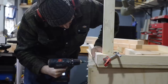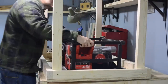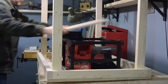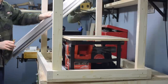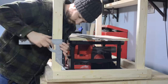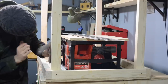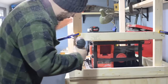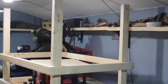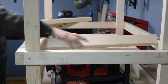Another reason for making my own custom bench is I want it to be a few millimetres higher than my outfeed table, so wood will pass nicely over it onto the table. Originally my plan was to use the little square that came out where the saw went in for the saw to sit on itself. I got that in place and then got a straight edge — one of my Festool rails — to mark out where the second frame will go. Later I decide I don't like that bit of wood there and I remove it, but it still worked for marking everything out. I like this method of having the saw upside down in the bench so you know when everything is put together that the top of the saw will be flush with the top of the table. The second frame gets installed exactly the same way and then I can put some supports in to go under the saw itself.